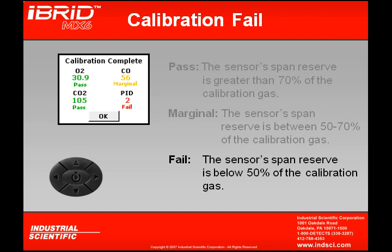The last condition is the fail indication, which means the sensor has failed the calibration — it couldn't even detect half of the gas that was applied. Fortunately, as a user, you'll never have to determine if a sensor fails calibration yourself. If a sensor does fail, the instrument will fail it automatically, and back in the real-time operation screen, where that sensor reading once was will now show the word 'fail' in red.